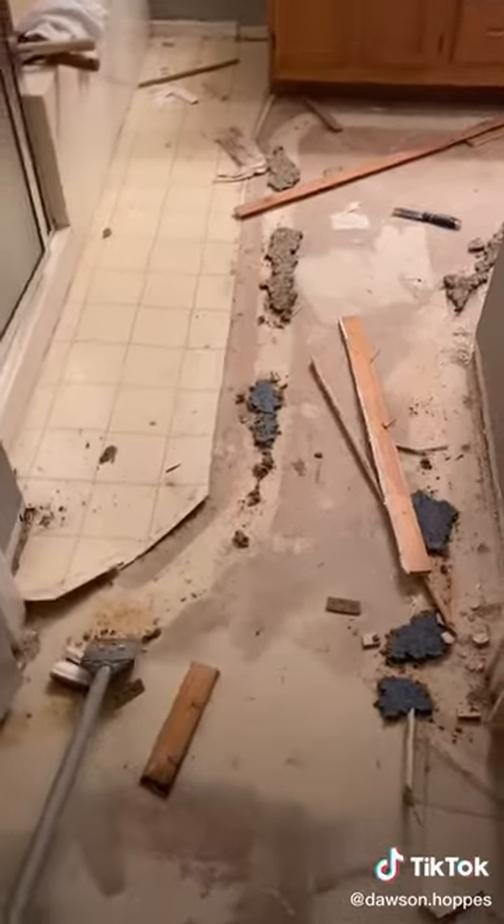After that I got my floor scraper out and peeled up the linoleum, which was by the shower and the tub. That was actually a little bit harder to pick up just because it leaves a lot of residue. But after cleaning the floors, I gave all of the walls and the cabinets a good clean with TSP, then gave everything a really thick coat of primer to get started on the painting.